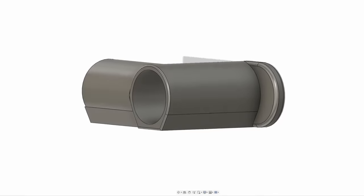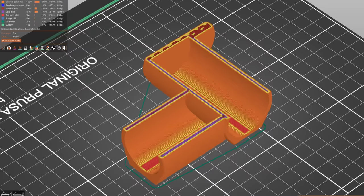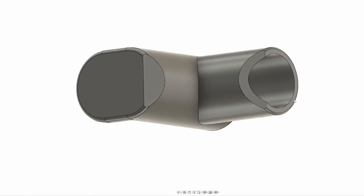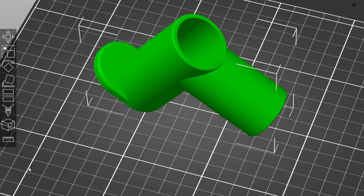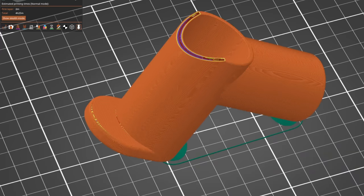I prepared two ways to fix the model by daring to deviate just a little bit from its original design. The first one is by simply creating at least one flat surface we can print the part on. This will make the part a bit stronger, but it also introduces a steep overhang inside the tube's top which might need some post-processing later — not a big deal if you have a workshop with a round file, but not suited for everyone. The second approach is simply introducing a flat area where you can print the part at an angle. Ideally this would be directly accounted for in the design file with a large enough surface area. If you're desperate, you could also do a poor man's attempt directly in your slicer by cutting off just a tiny bit and adding a large enough brim to prevent it from falling off the bed.